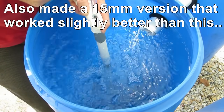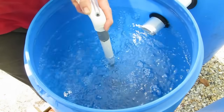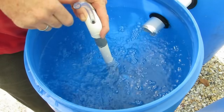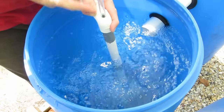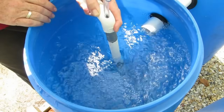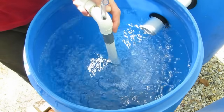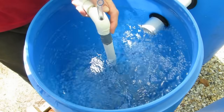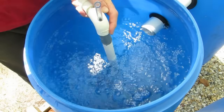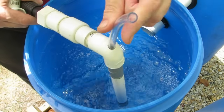You can adjust it — increase and decrease the airflow — just by raising and lowering this pipe. That just increased it a little bit there; I think I've gone past the sweet spot. By raising and lowering this pipe you get different amounts of air being sucked into the system, so that's a good deal of air coming through. Maybe not quite as good as the other one with the irrigation fitting, but it's definitely supplying a lot of air down to the base of the drum.